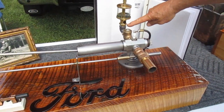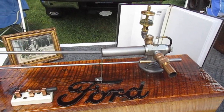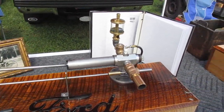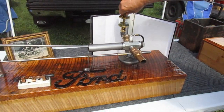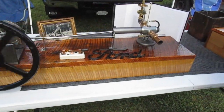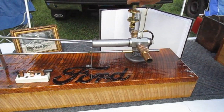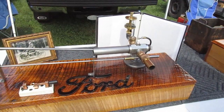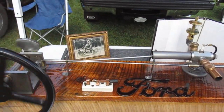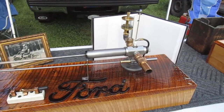There's a piece of screen in the bottom of this elbow that will atomize the fuel at the right proportion. It has problems on a windy day because that disturbs your fuel drip. The drip is really close to every time it hits, but the wind today is disturbing the drip of the fuel. When that gets disturbed, it changes how the engine runs.